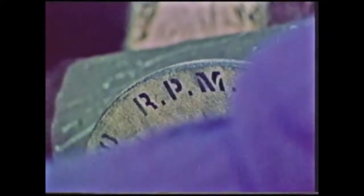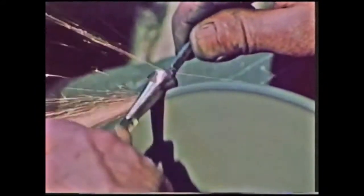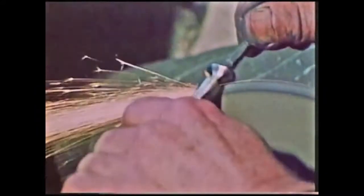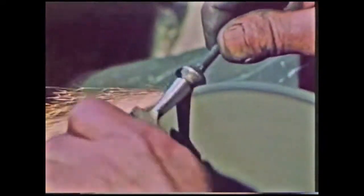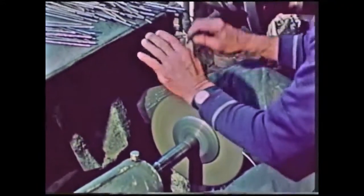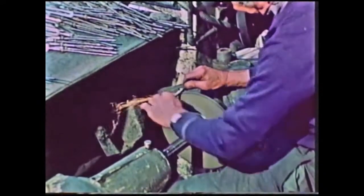By that I mean that one hand mustn't keep moving out of sequence with the other. Both fingers must go together in order to keep a level surface on the fork that you're doing. If you were turning one of these round, you can imagine what would happen if my hand was starting to move. Instead of that being kept perfectly round that way, it would be wavering. It's got to be kept in a perfect round, smooth motion all the time. And this only comes with years of practice. In fact, I would say that it's harder to learn than doing the instrument, because it takes longer.